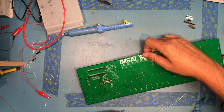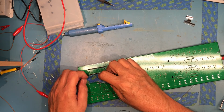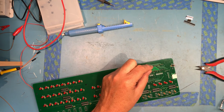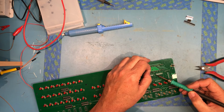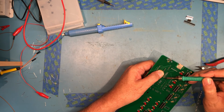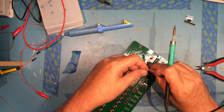We've got pin headers. A long one. This will be tacked two corners. Then press it tight into place. And then finish soldering it. So let me tack two corners. And apply some pressure to it. And it wasn't in flush. Didn't really expect it to be. It looks flush. Finish soldering it.